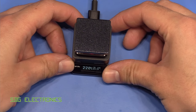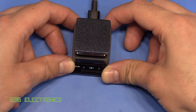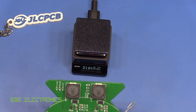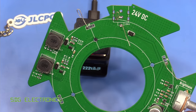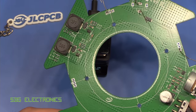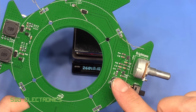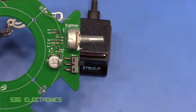We'll adjust the temperature up a little. Holding down the A button lets you increase the temperature. It goes all the way up to 350 degrees C. We'll try taking a few components off a board — we've got the old ring light PCB from JLCPCB. In the next video we are going to finish that project. JLCPCB use a lead-free process for their assembly service, so it needs a slightly higher temperature — probably not 350 degrees C, but there will be some losses through the board. We'll see how it copes with removing some of these components.